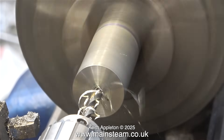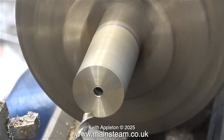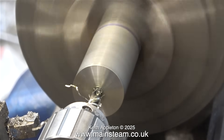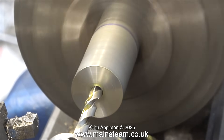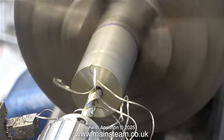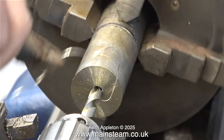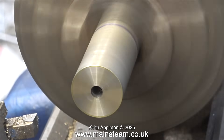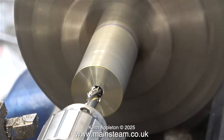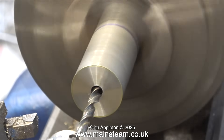I'm using a 5/16ths of an inch diameter drill bit, which is too small, and as soon as it gets three-quarters of the way down into the hole it starts to bind. To lubricate the drill bit I'm using some superheater steam oil — it's a very good extreme pressure lubricant. I also use superheater steam oil when threading with taps and dies. I've selected a larger drill bit now to go into the hole and drill it a bit deeper. Be careful with this swarf — it is razor sharp. You can see I removed it with a pair of pliers. Once I drilled as far as I could with the larger drill bit I went back to the smaller one, and the clearance allows the swarf to get away so it doesn't bind.